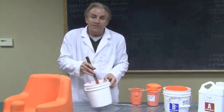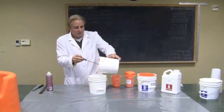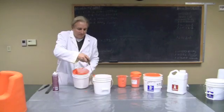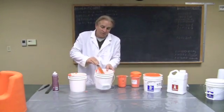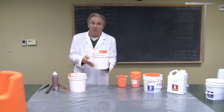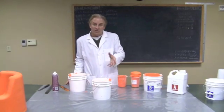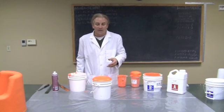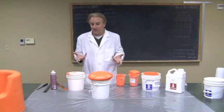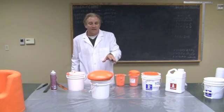If you don't know what a jiffy mixer is, you can go to our website. We'll take a clean bucket and a little spray release because we're going to show you a demonstration mold. Pour our mixed ingredients in there, then mix it one more time. It's always best to use two buckets because in real life if you're pouring a mold, this would be the bucket you'd pour into the mold. We're just going to demonstrate and pull a plug to show you what the foam looks like. This is free rise density — the foam is not going to be compressed against itself. Here comes the foam. But in most cases when people mold parts, they're going to take this foam and compress it back to force the density up and to increase the integrity of the skin.